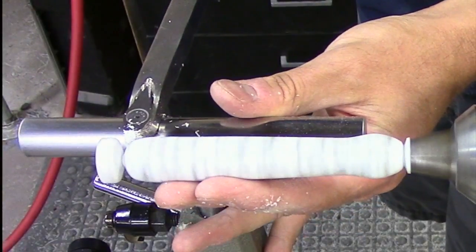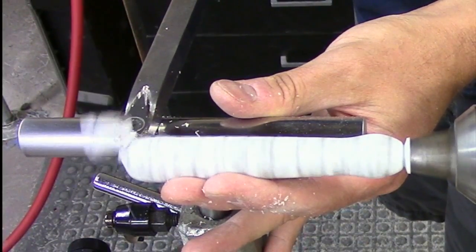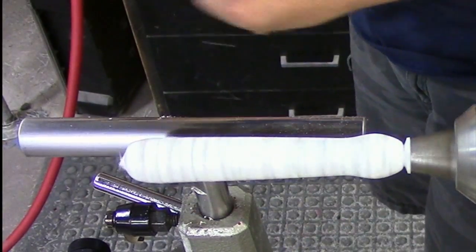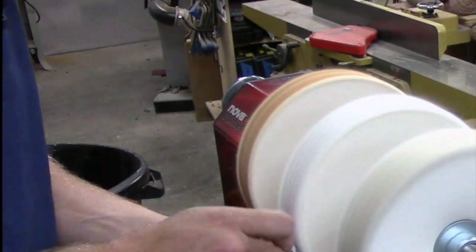Probably good to give it a little bit of pressure with my fingers. We got through the turning and had no major mishaps with this blank — I'm actually really surprised. A lot of times smooth materials, plastics and all that, the bond is really not that good between the resin and something smooth, so I was a little worried. But having the holes and the different features on the faces I think helped — the resin had a little more to grab into. I was pretty careful turning it.